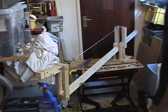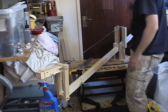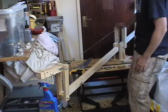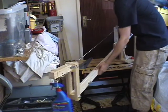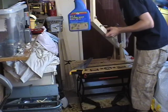Here we have the first little test of the boom. You can see the arm here. Put the bolt through the main part of the fulcrum, extended it up to the correct height because I messed that up in the first place. Got the cable running down here to the head — and there we are, the head stays level.